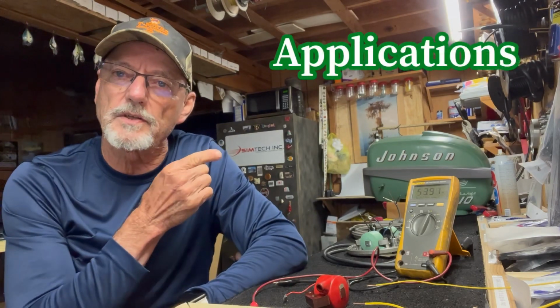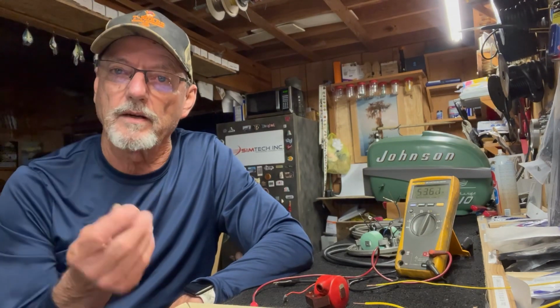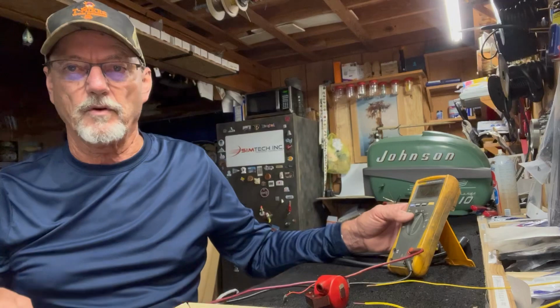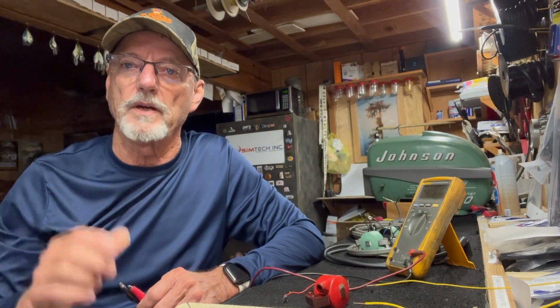Okay, so now in part 4 we're going to talk about the applications for a voltmeter when it pertains to vintage outboard motors. As I said earlier, we don't really measure voltage itself. We look for ohmage and resistance, and I talked about it earlier, spark. Spark is so high, 20 to 40,000, and so fast, blink of an eye, that a meter can't really capture it. So we use a visual of a spark gap tester, and the amount of voltage needs to be a 1/4 inch gap. That's how we measure for spark.